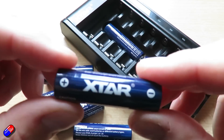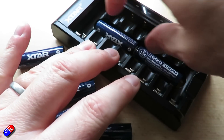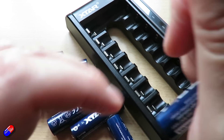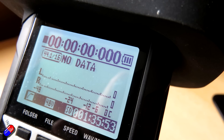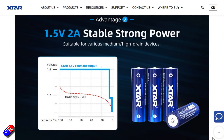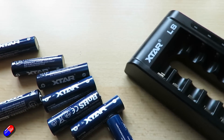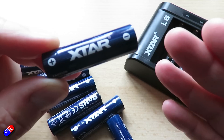The cells themselves operate very well. I've been using them for about four weeks with lots of positive experiences. There is one thing to be careful of though: because the output stays at 1.5V for so long, you don't get the same kind of warning that you would with a normal alkaline battery discharging — particularly on microphones and things. These kind of drop off a cliff once you get towards the end. So I'd get into the habit of regularly cycling them through the charger to keep them topped up, so you don't start using a device thinking it's got a full battery when it's actually only got 15% left.